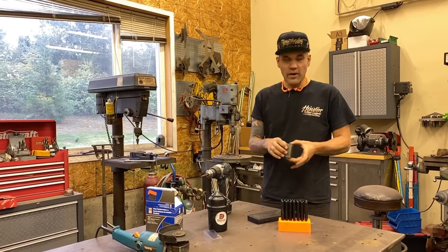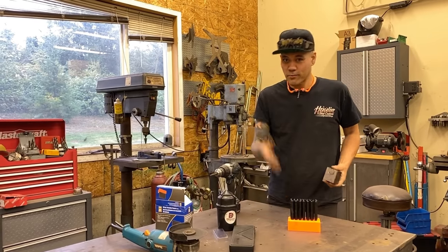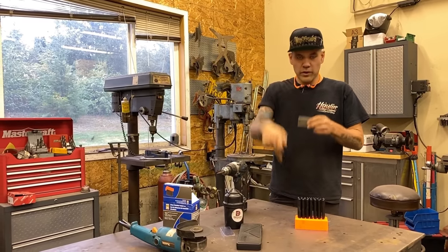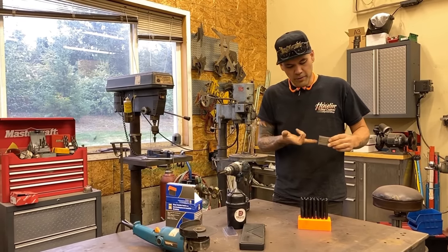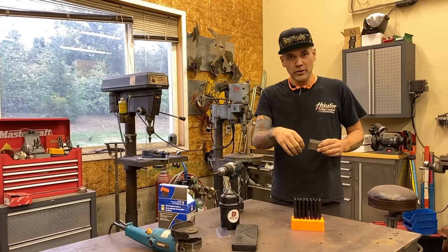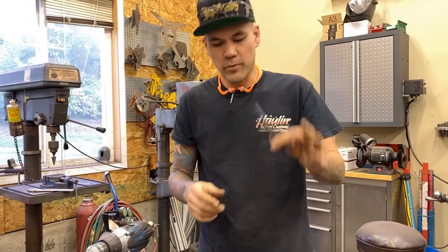This particular tool is very easy. All we're going to do is take a scrap piece of whatever — I've seen it done with aluminum. You don't have to use steel; aluminum wears out a little bit faster, but depending on how often you're using it, it might not matter. Renato actually showed us with aluminum — he had just some scrap block. So what I'm going to do is drill a hole straight through, then cut through the side to allow a piece of sheet metal to slip in. Then we choose the appropriate punch, take the tip off, make it a nice sharp edge so it will actually punch out a perfect disc.